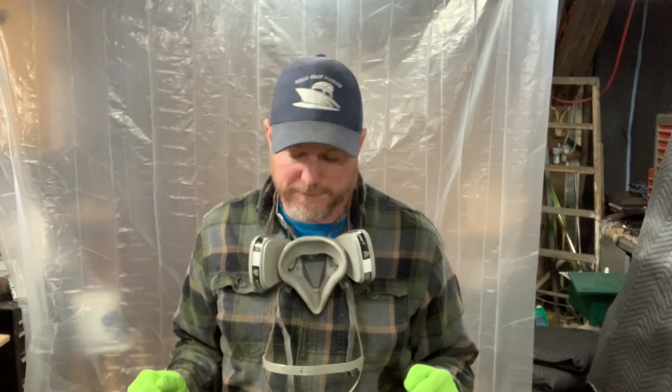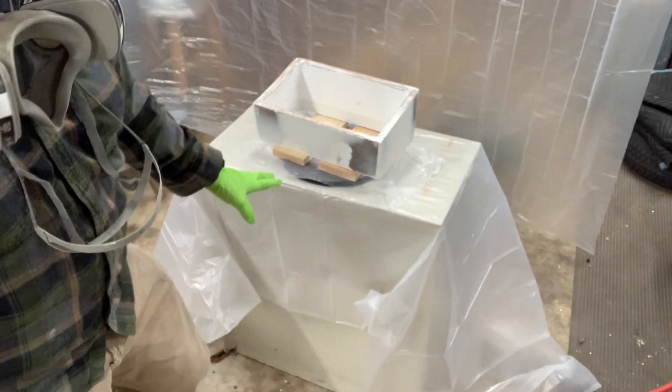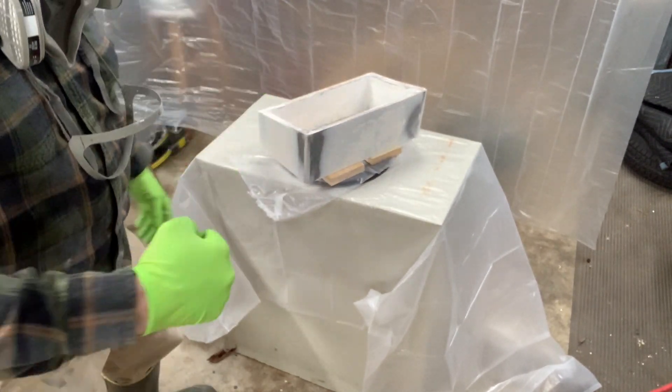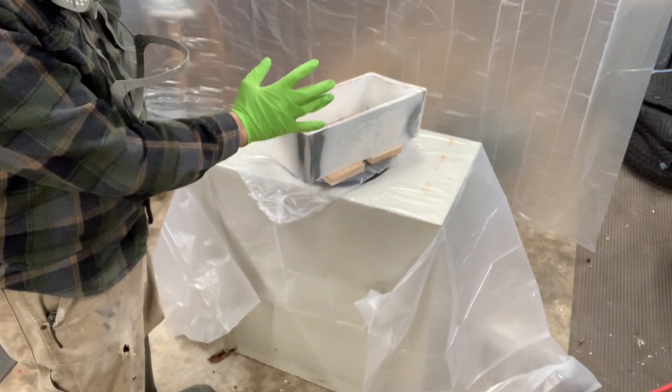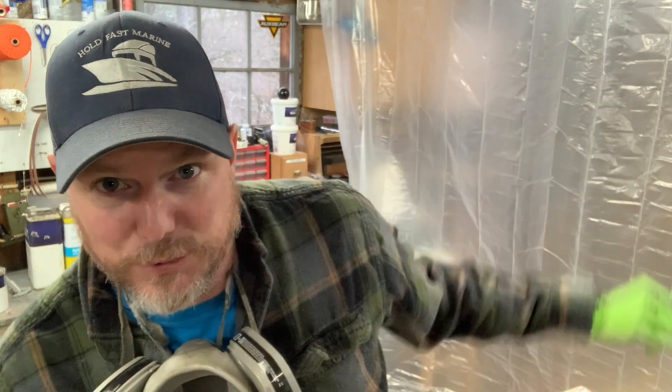Everything's sanded up and I'm going to spray my first coat of gel coat. The majority of the operation here is going to be on this old file cabinet and this Lazy Susan so that I can spin the piece. That way when I'm spraying, everything is going to be focused in this direction and caught by the plastic, hopefully. My heater's coming on right now and I'm going to want to shut that off before I start spraying — praying and spraying, pretty much. That's an open flame propane heater, and all this flammable stuff in the air could technically be ignited and blow me through the door, and we don't want that.